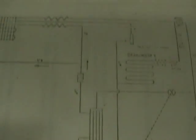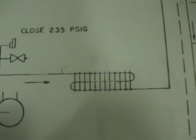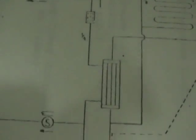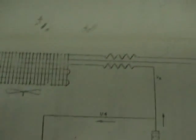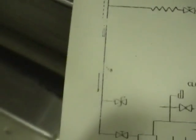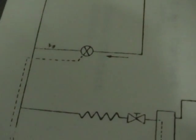There's the low-temperature circuit, which goes through the very small condensing coil to de-superheat the gas, then through the heat exchanger where it condenses in the cold evaporator of the first stage. Then the gas goes through a filter dryer, through an expansion valve, through the main coil inside the chamber, then back to the compressor. That's another TXV - actually I'm thinking that's a bypass valve.